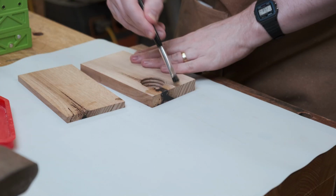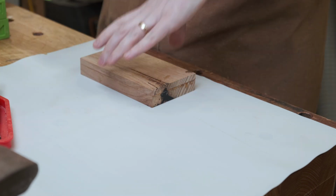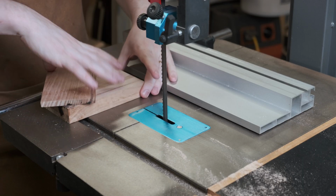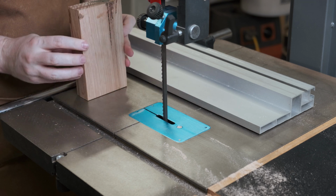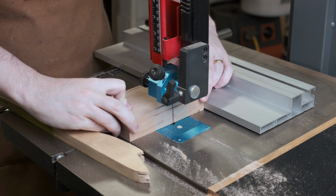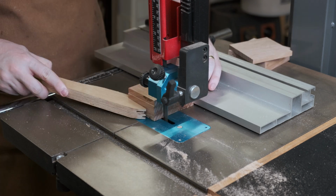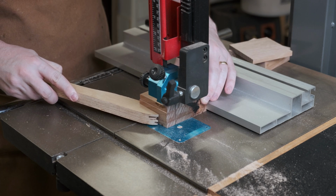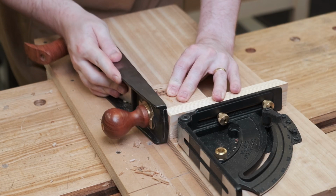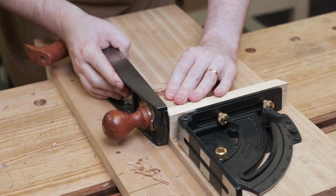The box body and base were also glued up. With everything cured, the lid was screwed onto the box, then it was all trimmed at the same time at the bandsaw to make it more ring box sized rather than a weird monstrosity. A little bit of cleanup with the shooting board and the box was ready for an oil wax finish.